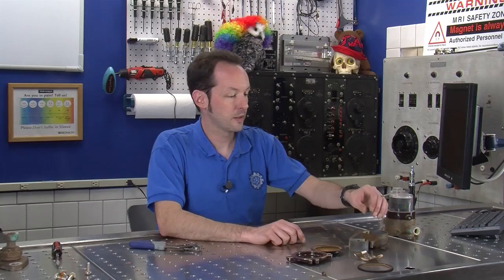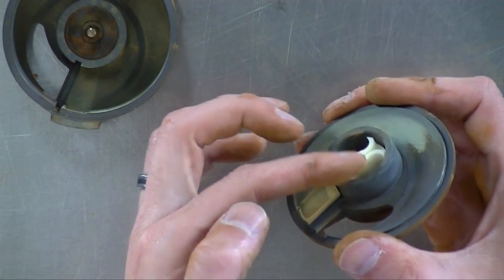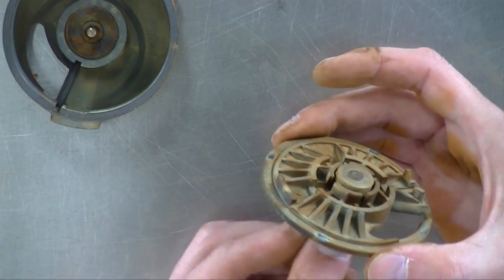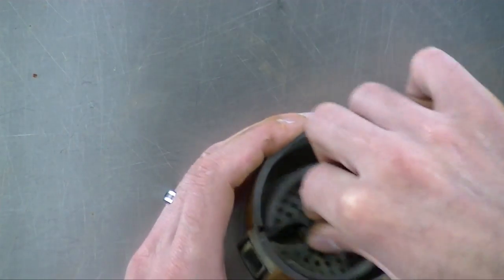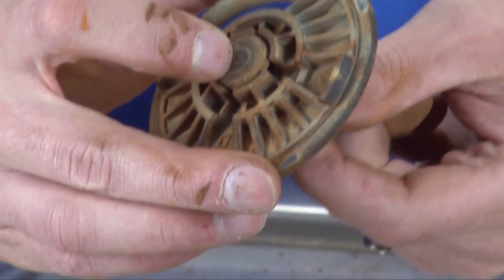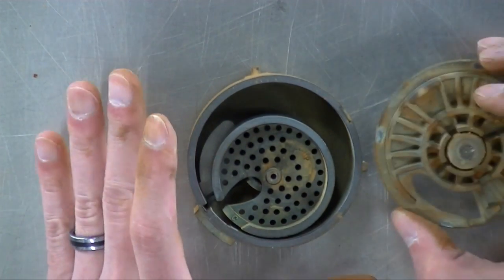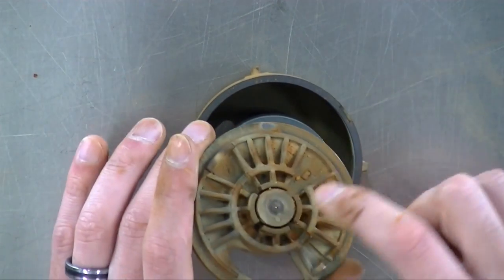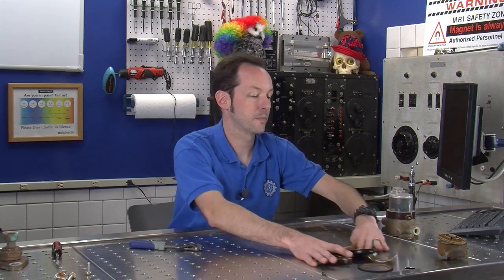So you know that, and as that moves around it moves this wheel right here. That little wheel turns around, and that little wheel is our magnet wheel — you can see the magnet on the other side. So that turns the magnet. The water moving through moves this, which moves this, and this is just a simple axle assembly that moves the magnet. So this handles the whole puzzle of how do you have a measured amount of liquid flowing through here, and you can know how much that is and make that actuate something.